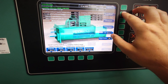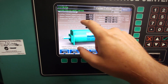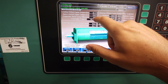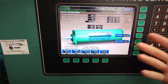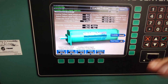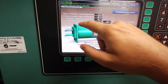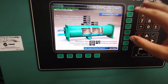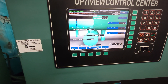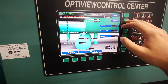From the main systems page we can monitor our pressures and saturations. One thing to really note while you're in the process of starting up — especially with a heavy pull-down — you're going to have really high small temperature differences, which is York's way of saying the approach value. Five degrees is not acceptable normally, but we're in a pull-down right now with really high water temps: 60 leaving, 73 entering. As the machine pulls down and gets closer to load conditions, that's going to dramatically drop. Even on the condenser we've got five degrees. Don't let that spook you — it's just adjusting that metering valve based off of this machine.